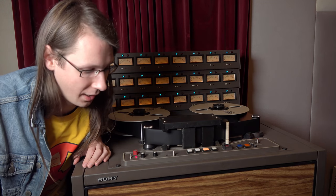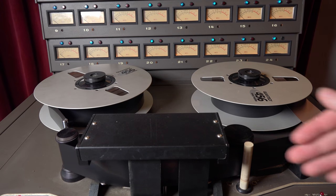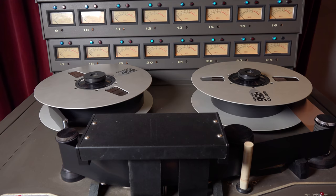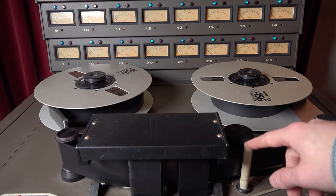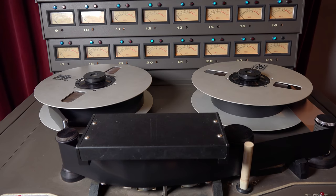Now let's look at the tape deck from the top down — there's a lot going on. There are three motors: one on each spool and the capstan motor. The two spool motors keep the tape tension intact, pushing the tape toward the heads. During rewind these do the hard work. The capstan motor is the precision motor — it precisely drags the tape through the machine and determines the running speed.